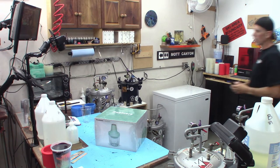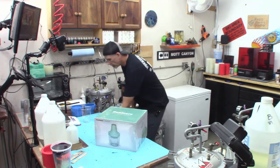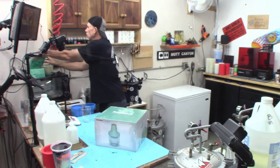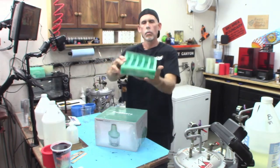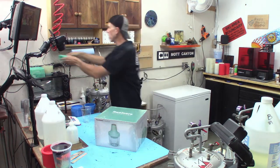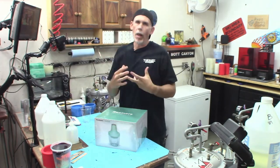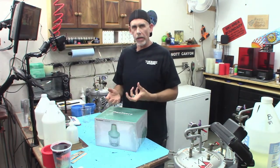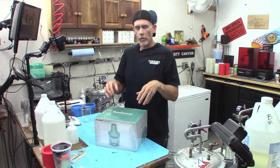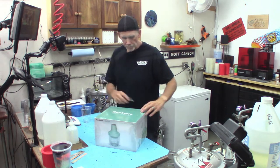But if all you're doing is one pen blank or smaller types of things, then I think you could probably fit enough resin to do the single blanks, something like this, where you just have a few pen blanks that you want to make. You could do something like this. Again, I don't know that pen blanks is really the greatest way, but if you're just getting into resin casting and want to make pen blanks, you don't have to buy a pressure pot. There are resins that are slower setting that will help get rid of air bubbles, and if you wanted to dip your toes in, this might actually be a decent way to go, even for pen blanks and stuff.